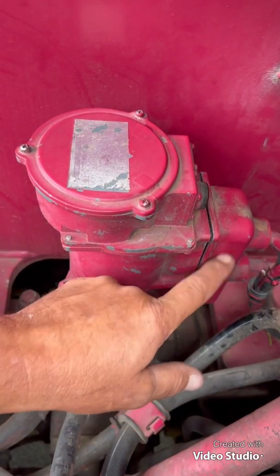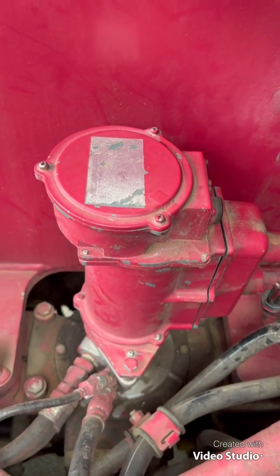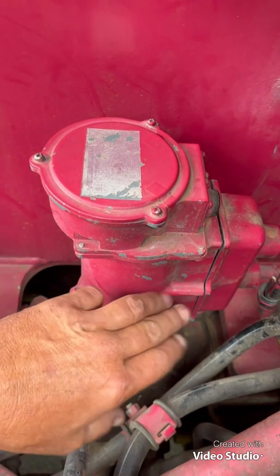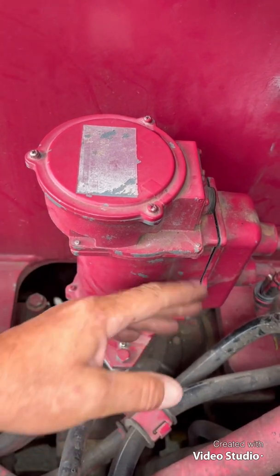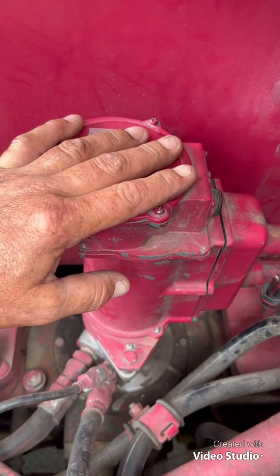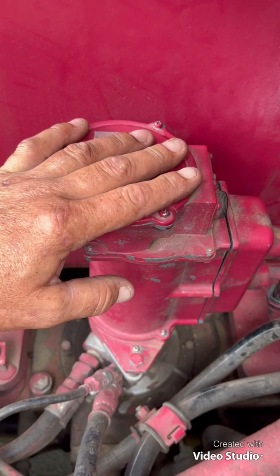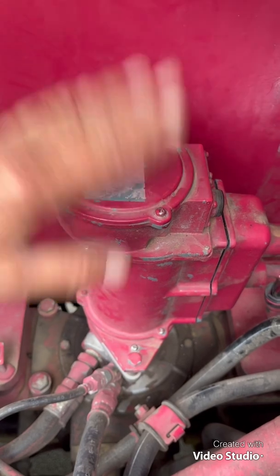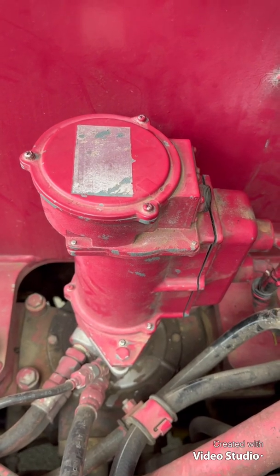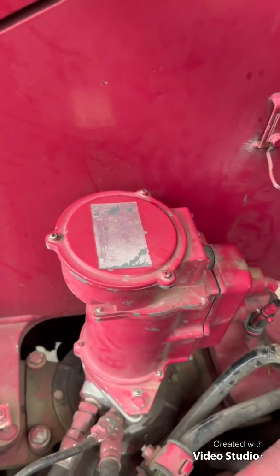The brushes wear — they're made out of graphite, or possibly copper forks — and crap collects in there. As you can see, it's a completely sealed unit, but there is debris from the actual wear and tear. This unit is about 16 years old — 2005 model, something like that. Anyway, I'll bring you back in once I have a closer look at what's going on.